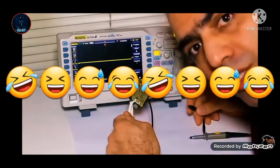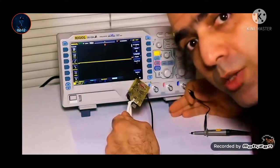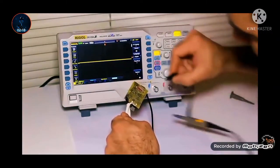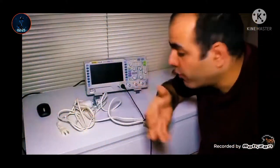If I probe the input AC... What's worth mentioning is that the rectifier output is only DC between its power and ground output, not in reference to the input wires. So I have to move the probe ground to the rectifier output ground, which is, I think, this. You might want to turn things off before moving things around to avoid shorts.